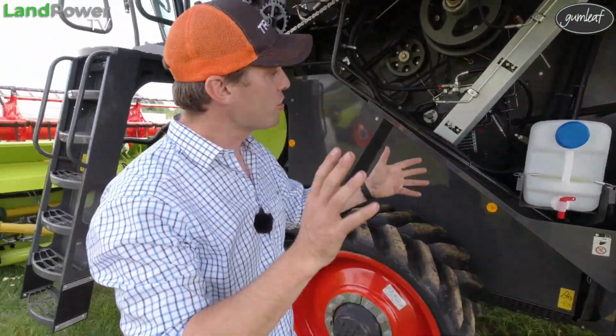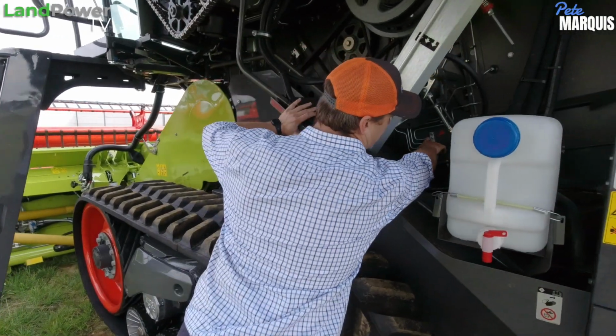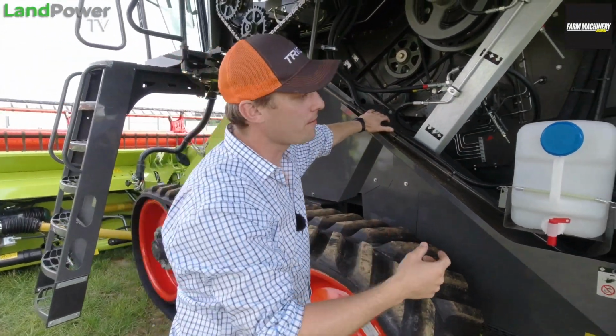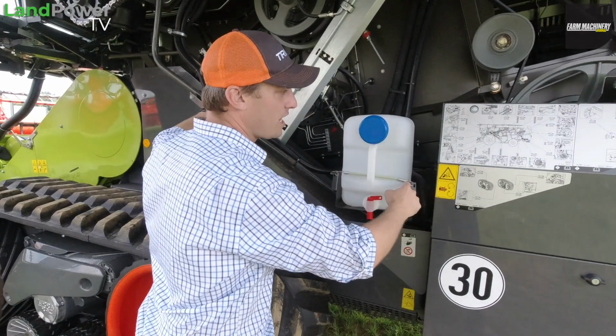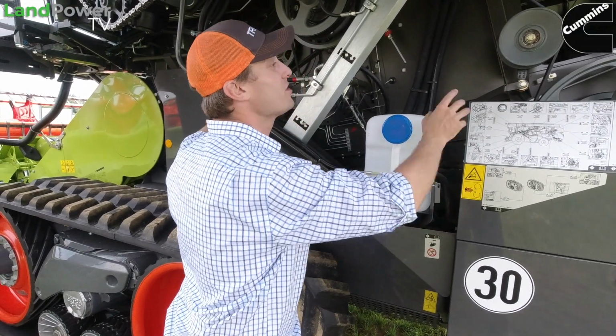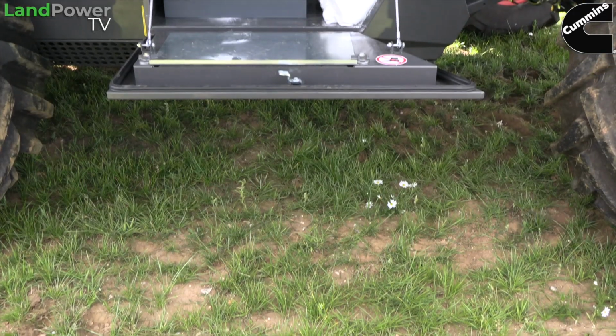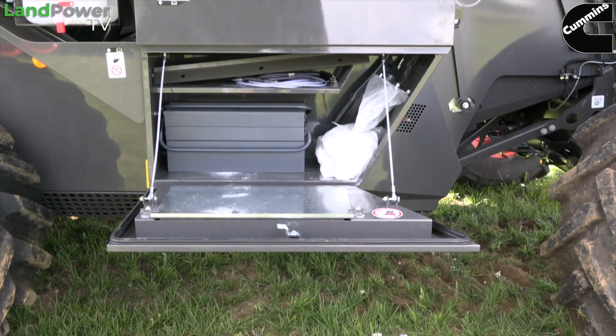As for a standard machine greasing, we have these banks of grease nipples on the sidewall of the machine. If you go for a comfort greasing, or easy greasing, there is actually another bank of grease nipples here that greases the whole side of the machine, so you're not searching inside the machine. But from a maintenance point of view, there's no 10-hour grease nipples on these machines.